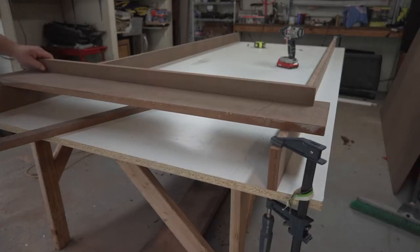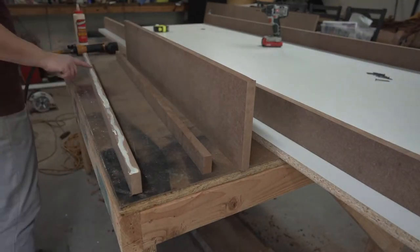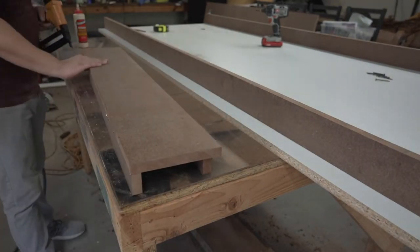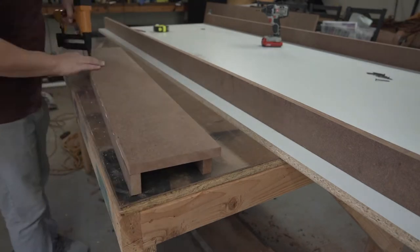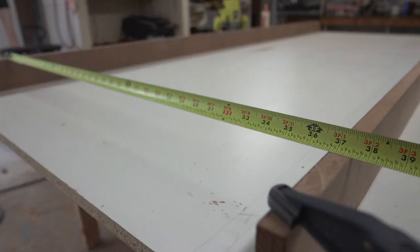It's time to start slapping that router sled together, so I took some measurements from the outer rails and the base of the router and started cutting up some MDF board. I left a very small clearance for the router base, which has a flat spot on one side, and you'll see when I do the test fit, because what I don't want is the router bit catching or binding on material while it's cutting, possibly spinning the handle around and injuring me.